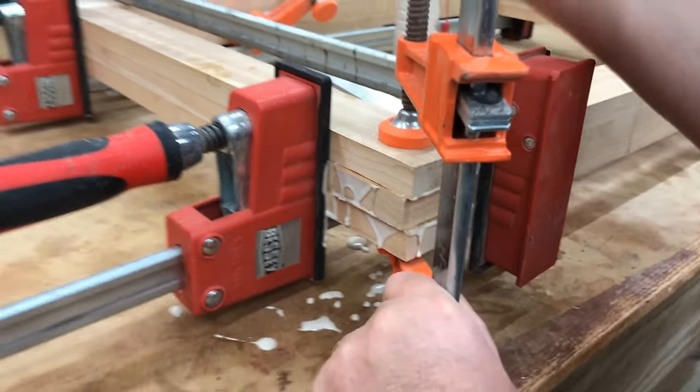Now I've got to turn my leg assembly over on its side. And that'll allow me to drop that cabinet in on that side and begin to attach it. Ideally, you'd cut it perfectly, or possibly where the cabinet is maybe a 16th of an inch smaller, so it goes in nice and snug, but it goes in smoothly as well. And the next step after that would be just to attach the cabinet to the frame structure everywhere and to the shear web piece in the back as well.